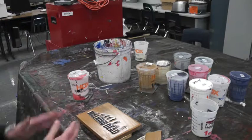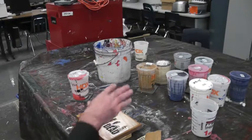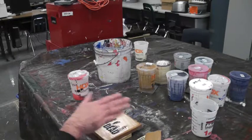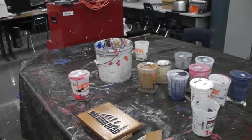Once this dries, you'll be ready to add a hanger to the back if you want one, and then take it home. This is a three-day process: stain and let it dry, put the first coat of clear on and let it dry for 24 hours, lightly sand it, then put a second clear coat on. This isn't a one-day thing, so just take your time and you'll end up with a really nice product in the end.